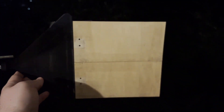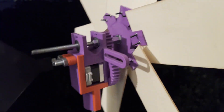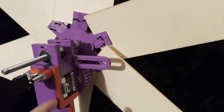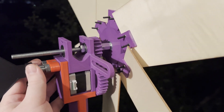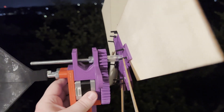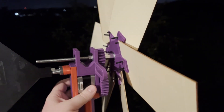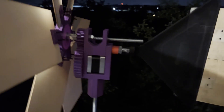That two-bolt design left me some extra room to just slap one on. This is obviously a work in progress, but it works well enough. You can see over on this side there's a tensioner right here — that's what it was going to be for — because I designed this to also work with GT2 timing belts or polyurethane belts, but I decided to go with gears just because this was such a simple ratio that I might as well just print some chubby gears and put it on there.